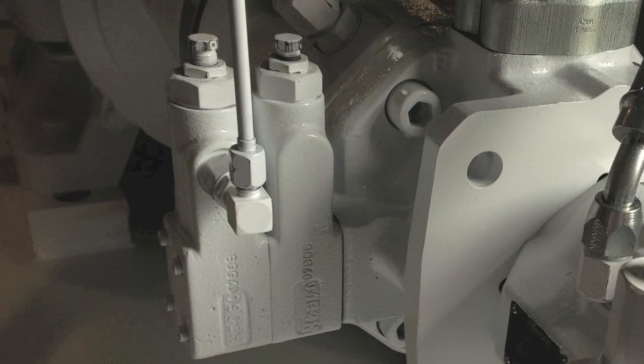Although we recommend that you contact us should you desire to make changes to your DFR pump settings, we will touch upon how to make adjustments in the upcoming video. Should you simply need to increase the speed of any tooling plumbed to the tool pressure side of your system, you should be able to do so by simply adjusting the Sun NFFD-LIN flow control valve identified as number 11 on your schematic.